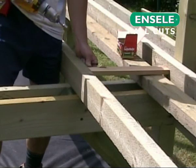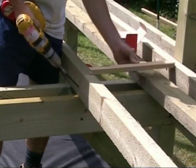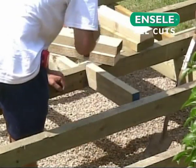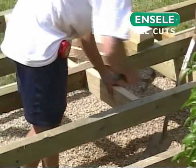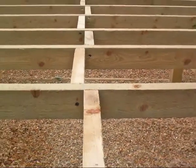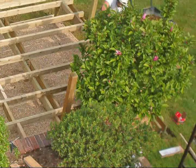Continue to fix the subsequent joists across the beams. To maintain a consistent width between joists, a short piece of timber cut to size is a useful device. Once all the joists are fixed, noggins should now be fitted throughout the subframe. These are short pieces of joist material fixed between the joists to provide extra rigidity to the whole subframe. Noggins can be fixed using screws or high-quality galvanised nails. We have also positioned noggins around the magnolia shrub to create a mini-frame that will provide support for the subsequent deck boards.